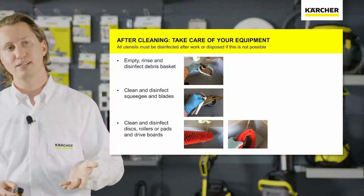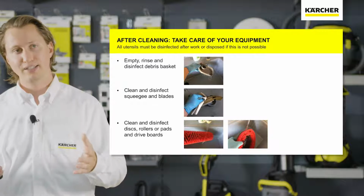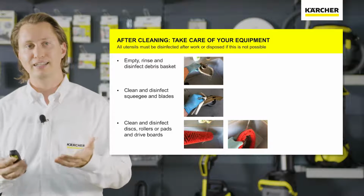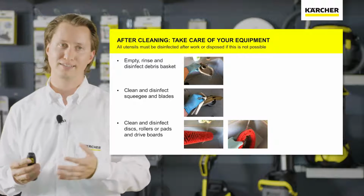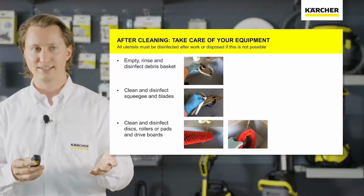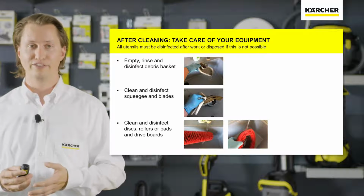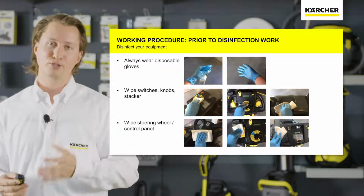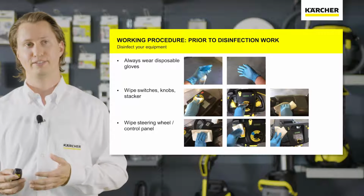After the cleaning process was done, make sure to take care of your equipment. Empty and rinse and also disinfect the debris basket of your machine. Clean and disinfect also the squeegee and the blades. Also clean and disinfect the discs, rollers or pads, and the drive board of your machine. Of course, doing this, you have to wear disposable gloves and a safety mask in order to protect yourselves at this point. Before starting to use the machine for the disinfecting job, you have to disinfect the machine itself.